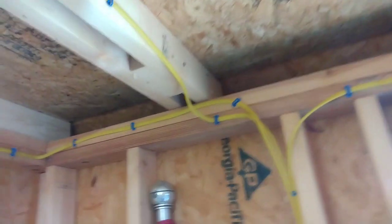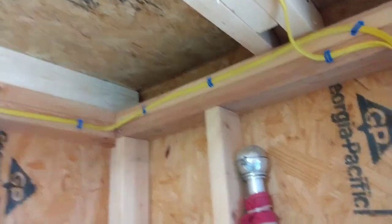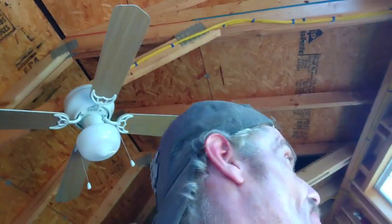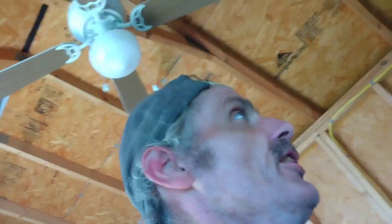If you're ever running your own wires, run them neat. Even when you've got to group them together, make it so you can look from across the room and see: okay, this wire is the bottom one and it runs over here. If you're having to chase down wires later you want to know what plugs to hook them to. If your wires are all jumbled up and just thrown on the wall, when you go to hook in your plugs and switches it's a mess. Standing on this end of the building looking that way, I can tell that wire's the main hot line in, so I need to have that over here and branch off of it for all my other switches.